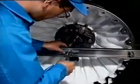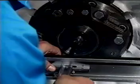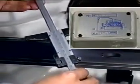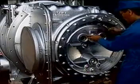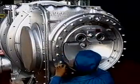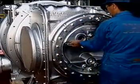Measure the distance K at the compressor and check if it agrees with the figure shown on the plate attached inside the compressor end bearing space cover. Remove the mounting bolts of the turbine end bearing space cover. Screw the puller screws into the three positions, then remove the bearing space cover by pulling it evenly.